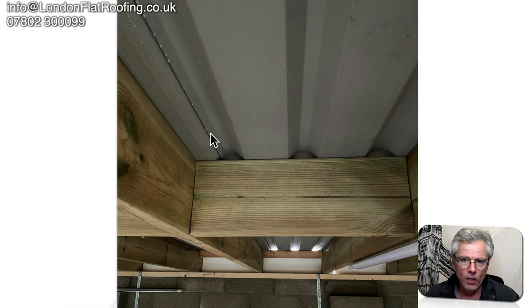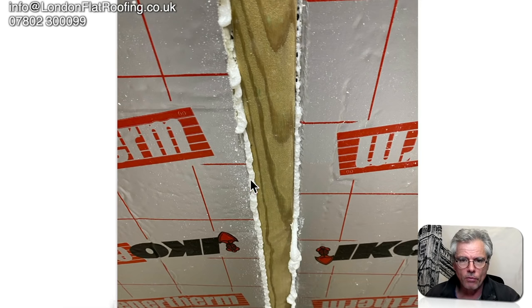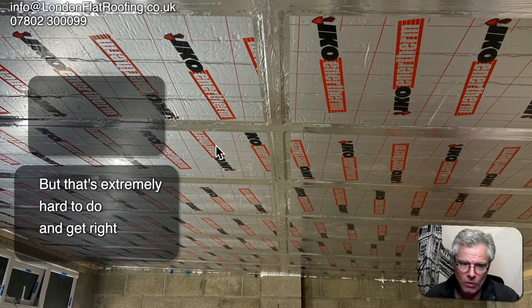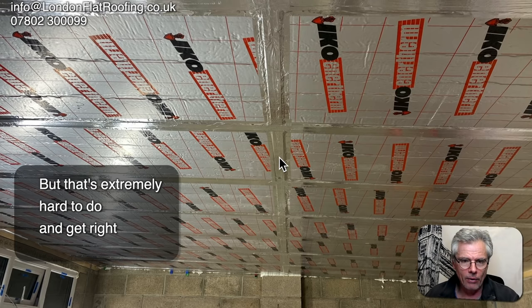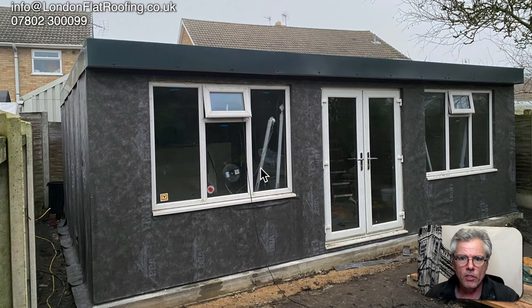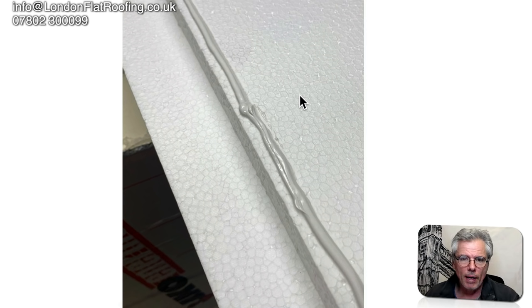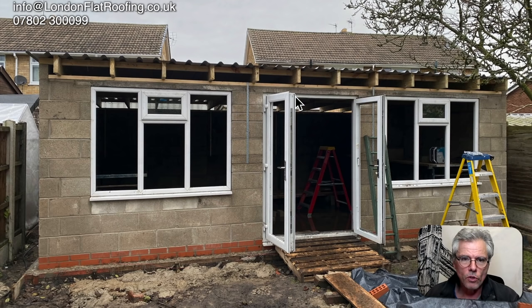Mainly, how to get rid of the sweating on the inside. Looking at the photographs first of all, this noggin is too high and he's not allowing for any kind of ventilation front and back. He's told me he hasn't allowed for any at the back but he has at the front. He's already put some insulation in and he's using the foil of the insulation as a vapor barrier, which is not really the done thing, but it's an outhouse so let's assume that's great. He's showing us the venting at the front just there.